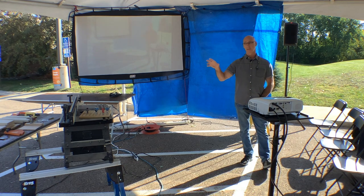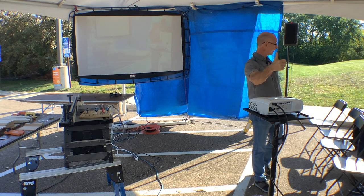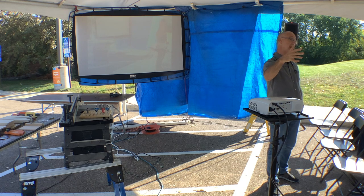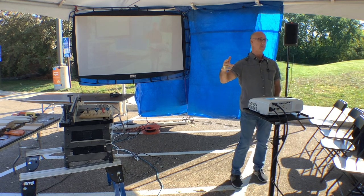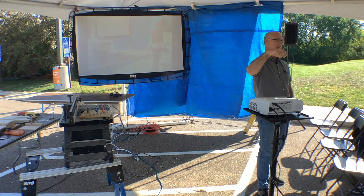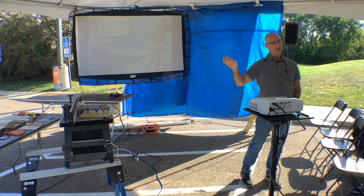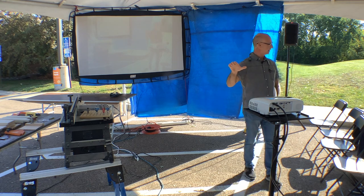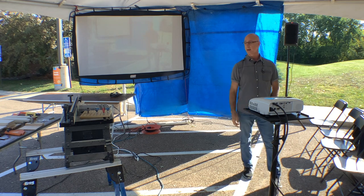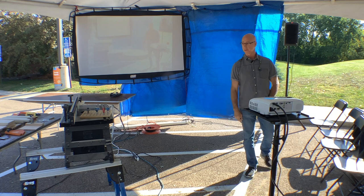To do a similar setup without a lift, there are tools from Triton, a great example, where a lift type mechanism is built right into their routers. The Milwaukee routers have a screw thread you can access from above the router table that can help you do height adjustments. In my experience with those, they're not quite as finite as a lift. A lift is still the best way to go, but as a workaround to save some money on buying a lift, those products are a good alternative.